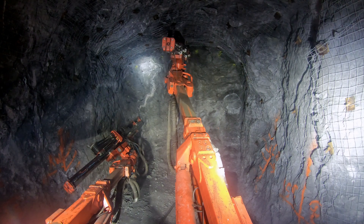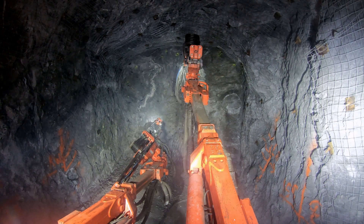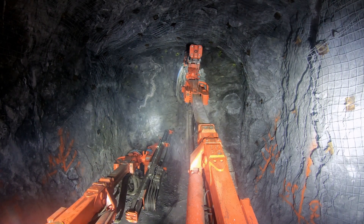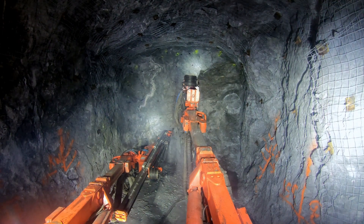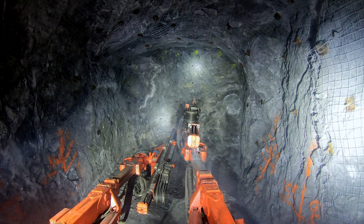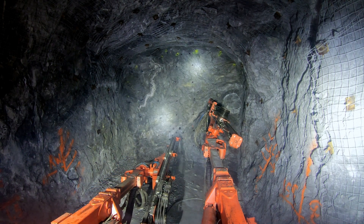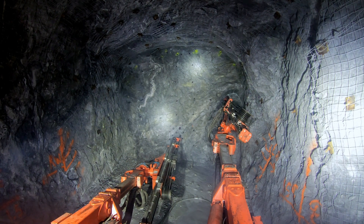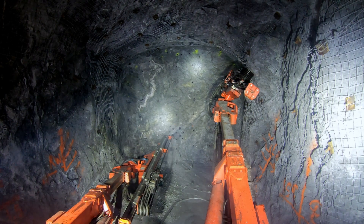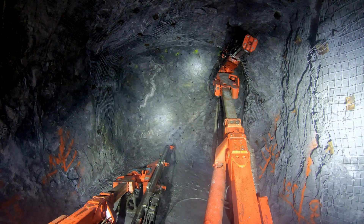If it's really bad ground, it's preferable to do the cut higher up because there's less weight and pressure on it, so it doesn't squeeze as much. I used to do my cuts really low because it makes it easy for the loaders — you load all your top stuff from the basket and one guy can load easily from the ground. It's also easy to tie in, especially with handy dets. If you've got a cut high up it can get confusing for people on how to tie them all in. You can see with my left boom reaming there how close the back of the slide is to the elbow — a good example of why it's nicer to have the cut in the center, high or low.